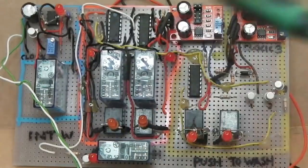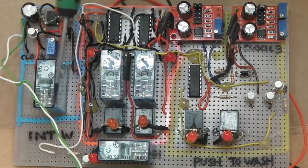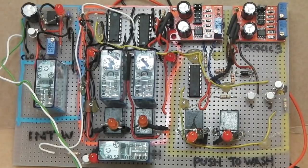That is the end of that. There's nothing else on that board. Forget looking at anything else at the moment. That's just a click timer, and that is it. Firing the relay goes across the contacts of your wiper switch, creates intermittent delay.